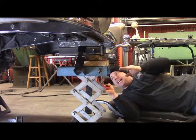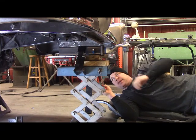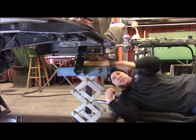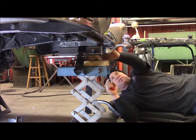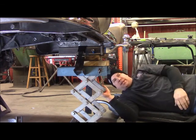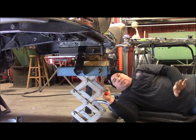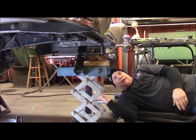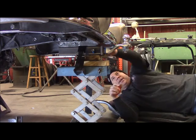Alright Bruce, I've got your truck sitting here about 10 inches off the ground where it would normally sit at ride height with the tires on it. I took that 10 inches and subtracted it from this, and it tells me exactly where this is going to sit in relationship to the ground. I did that to make sure it wasn't going to be low, because it is a little lower than the hitch and I've lowered the whole thing down. That's going to put it at about 15 inches from here to the ground when it's sitting out there — that's a good spot, about where all your full-size trucks are within an inch or two. I've got one out there right now and it's just over 15, so that's going to work out good.